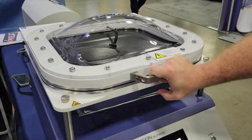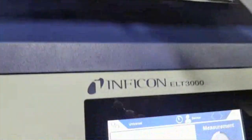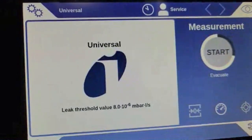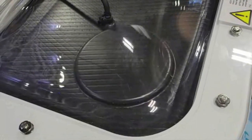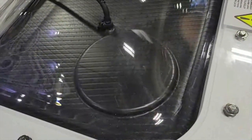We're going to run about a 30-second cycle time. If you look inside the chamber, you'll see how our flexible membrane is conforming around the calibrated leak device. That way we get minimal volume, and with the boundary layer we don't clog a leak.